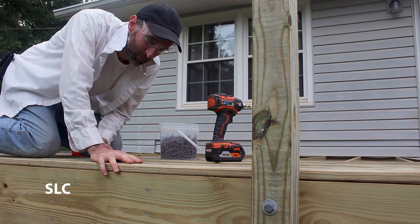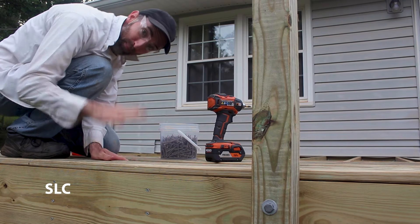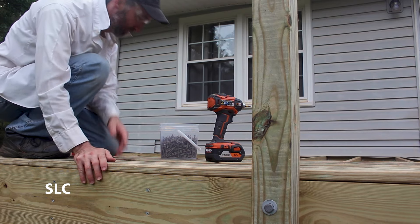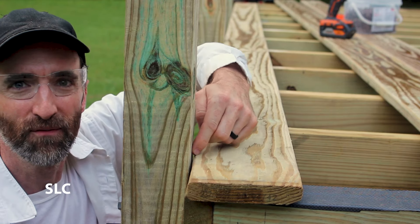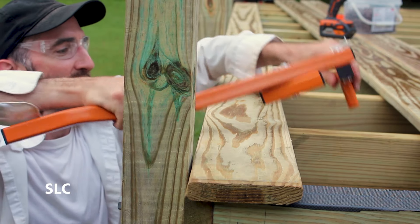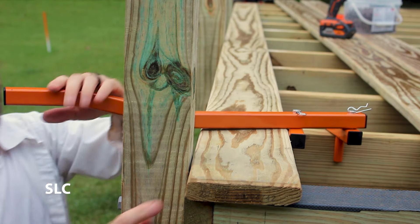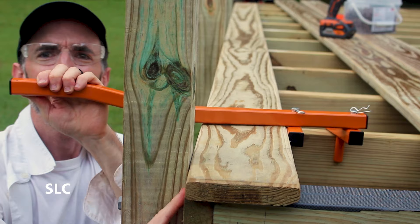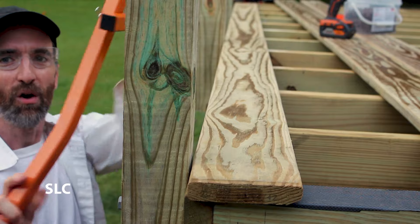As you're putting your first decking board down, it's not only a good idea to make sure it's straight, but also to put weight on it from above so that you're pressing down and you know everything is going to be nice and secure to the joists. When you're trying to put decking on you'll see that it flexes a little bit and it's not fully flush against the board. I have this new tool that puts pressure against your joists and allows you to straighten out that decking — you can see it moving just a very small amount, and that is a great help.